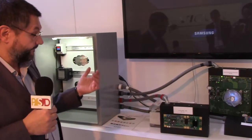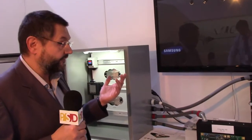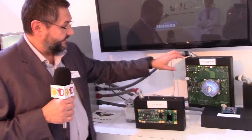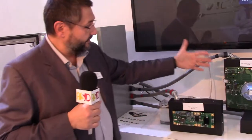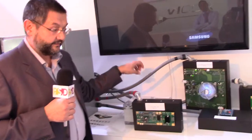Another advantage is that it operates directly from 48 volt — it gets rid of the 12 volt coming from the silver box. Having 48 volt means you have four times more voltage than 12 volt, so four times less current, which means 16 times less power losses over your distribution cable. Associating that with the high efficiency of the VR12 solution delivered by ViCore, you come to a very high efficiency. If you multiply this board to the thousands of boards in a server farm, you end up with a consistent energy saving — your total cost of ownership is drastically reduced, with electricity costs dropping noticeably over a two-year period just by increasing conversion efficiency and reducing power conduction losses on the cable.